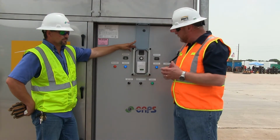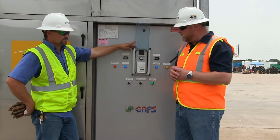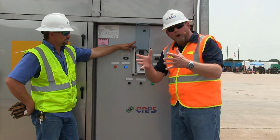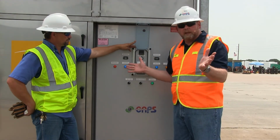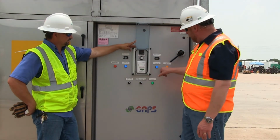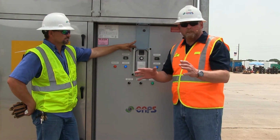In DH mode, it's just as simple as take the switch from leaving here, put it to DH mode, all the controls go away, all it does, it engages all the heat, all the cooling, and full fan. That's all you have to do for DH. No controls whatsoever, just turn the switch to DH. Now we've got heat and both cools running. All this machine's going to do is dehumidify and make water.